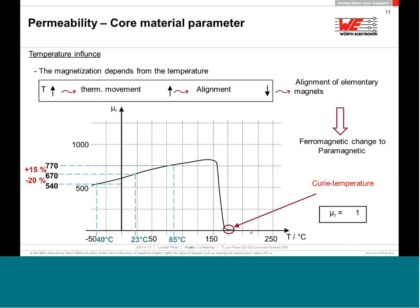As soon as you cool down and you are below the Curie temperature, the ferrite properties will come back and will not be destroyed. A ferrite is sintered between 800 to 1,800 degrees, so you will not be able to destroy that by heat. Of course, if you go to Iceland and you put it into a volcano, it will melt everything. But I don't care about the ferrite, you will take more care of the rest of the electronics.